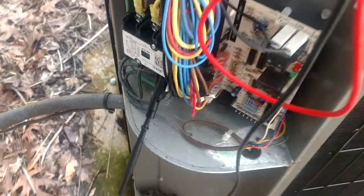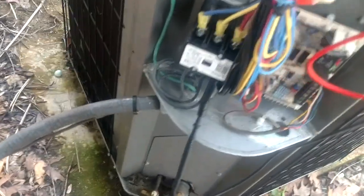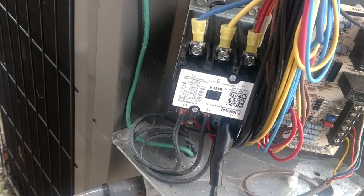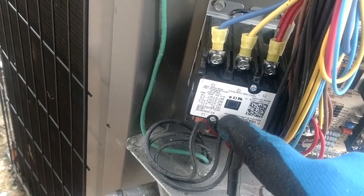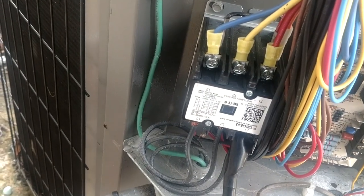That's definitely a good feature, especially for install crews. I think at least one of the guys or the foreman on every install crew should have a meter with the three-phase function, so they're not just starting units up running backward. It's pretty simple and cut and dry — the meter tells you what it's looking for. When it's flashing, just make sure you move to your third leg within five seconds so it doesn't throw an error.